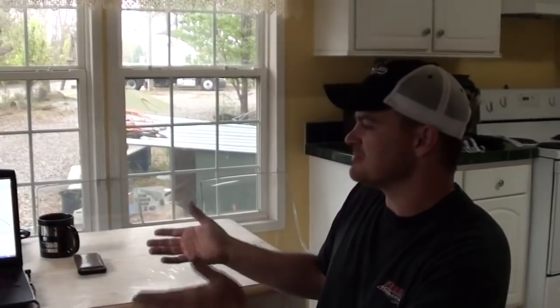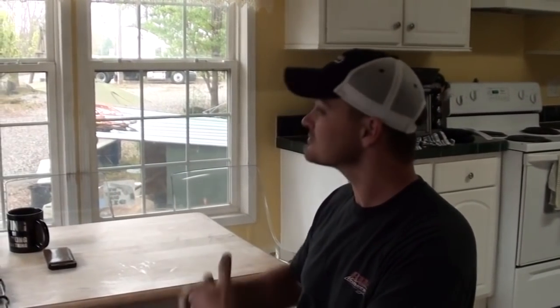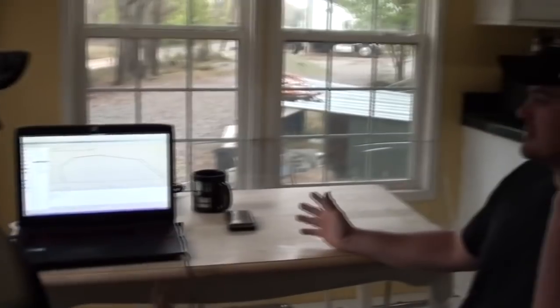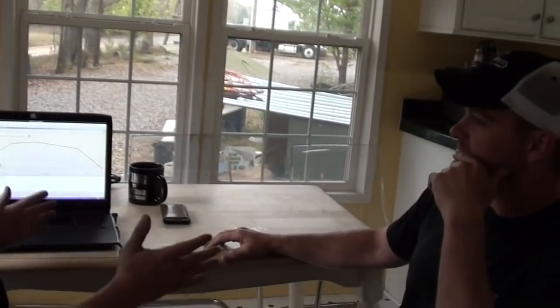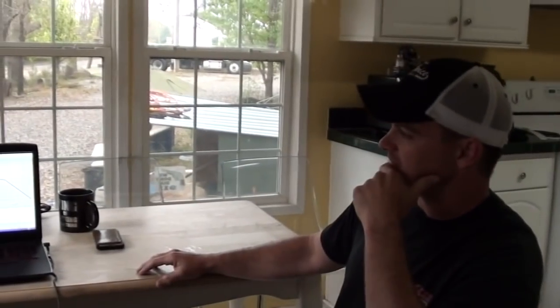The Cascadia is a fleet truck — very basic. My concern with all the ones I've looked at is the oil change interval. Big fleet companies will stretch them as far as they can — it's cost-effective if they're dumping the truck at 300,000 to 400,000 miles; if they don't change the oil as often, it's not on their problem anymore, it's the next guy's. Some fleets I talked to were going 35,000 to nearly 50,000 miles between oil changes — ridiculous. They said that's what Cummins recommends, but the engine maker is going to do whatever makes the fleet happy within warranty reason.